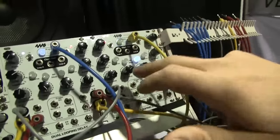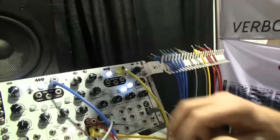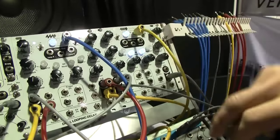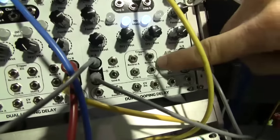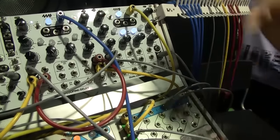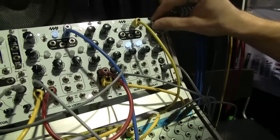So I could hold and loop one of these and then reverse it. Reverse and hold also have trigger inputs, which is really handy — you can take your loop clock to reverse the other channel on a beat, or take another clock from a clock divider to do four bars forward, four bars backwards, for instance.